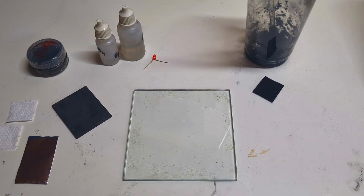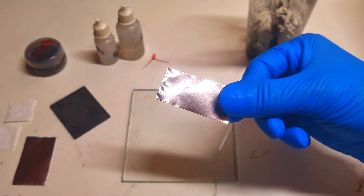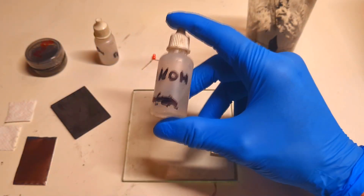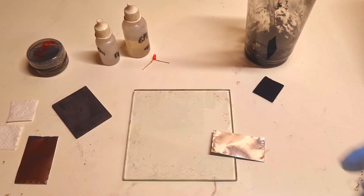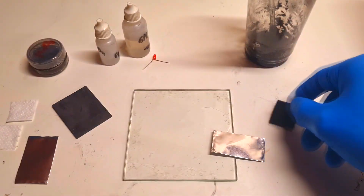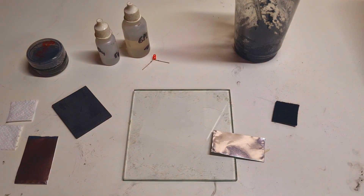If you make a standard aluminum air battery, you will need aluminum for the negative electrode. The electrolyte is in most cases potassium hydroxide or sodium hydroxide. And of course the cathode, or air cathode, is made from some sort of carbon — activated carbon felt or activated carbon powder would do the job really well.